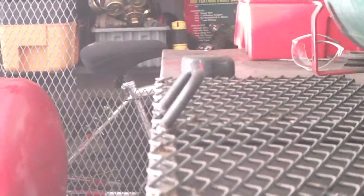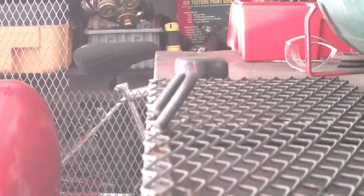What I did was I did this on a 45 there. You can see it's on a 45, so the door won't obstruct it, and it's just a little more convenient to grab on and pull out. There's my 1.5" by 1/8 angle we talked about. I just measured it all the way across. I use my square here, and also here, so I'm square all the way around. So we got a good fit with our tray.